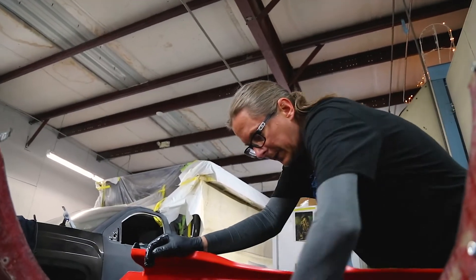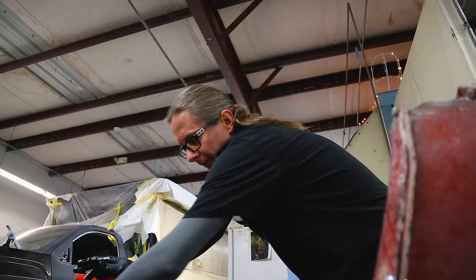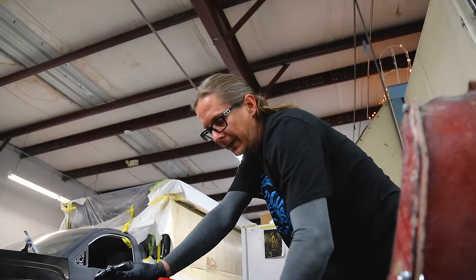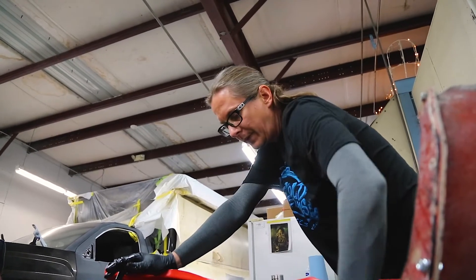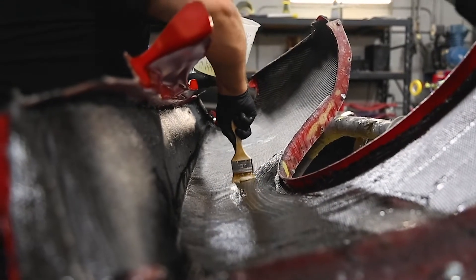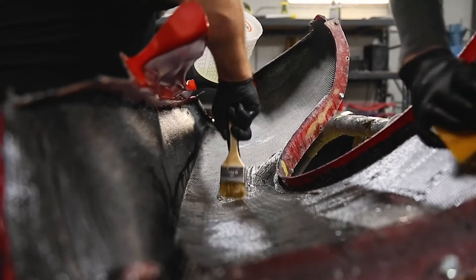A lot of times we like to do the infused parts because it pulls the resin through the part consistently, and you end up with the perfect amount of resin as long as you have a good vacuum. But with certain molds — like the molds we have here today — they're really not set up for infusion. An infusion mold would have a big flange all around the edges so that we could do bagging film and seal all that stuff up. Being that we don't have a mold that's appropriate for that, we're not able to do that, which is why we're doing this wet lay.